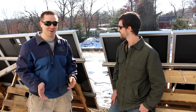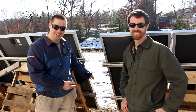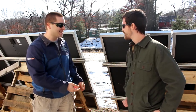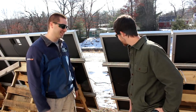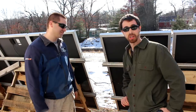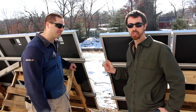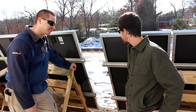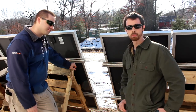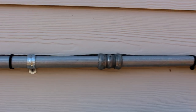We're on the backside, and one of the things I'm pretty sure I did wrong is I got the wires just kind of hanging out here between the two panels. In a professional installation, that'd be a no-go — an electrical inspector definitely would not pass that. Normally when you're going between your arrays you want to protect those bare wires, usually by putting them in EMT, which is the metal conduit you'll likely see on the sides of buildings.